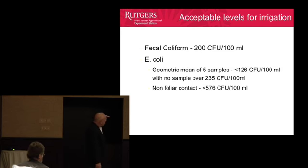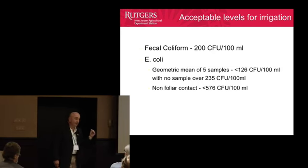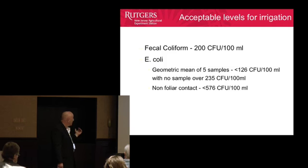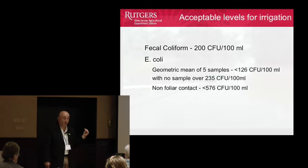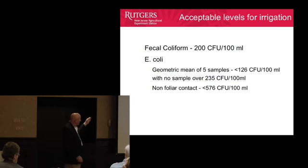This is in your binder as well as in Massachusetts water standards. Okay, Class A is potable water. Now I would say that we're lucky in this state that our potable water standard is not 0. It's 20 total E. coli colony forming units per 100 mils of water. In Vermont, it's 0. Okay, 0. We have 20.